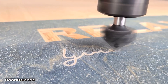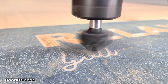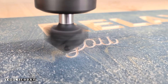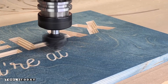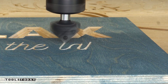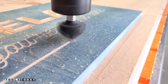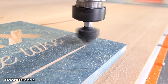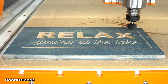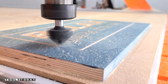This is also a really good bit for doing all the fine detail work as well. As you can see here it's going in maybe about 0.1 inch, so not quite an eighth of an inch. All the tool paths are generated in Vectric VCarve Pro software which has a built-in cleanup path in it. As you can see, the bit touches each part of the design two times. So I then used it to create a border around this area — a simple two-line area that I did a VCarve within, going through it both times.